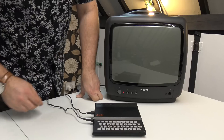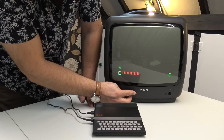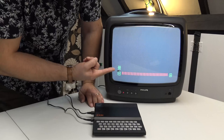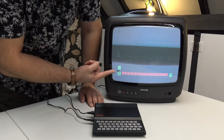We've definitely got a signal now, but we've got a black screen. So apparently this is quite common, and what it's down to is the fact that the video signals aren't very well emulated by the ZX81 — certainly the early versions of it anyway. In fact, some people have designed mods in order to try and accommodate for that.